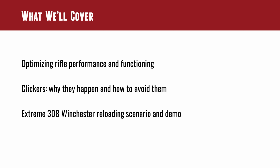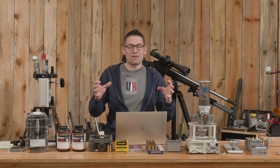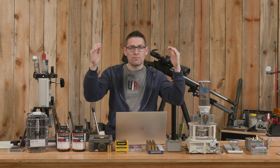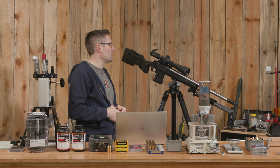In this video, I really want to get into what those phenomena are and talk about this correctness formula of the correct brass, the correct rifle chamber, and the correct sizer die dimensions that can bring all of this together and help to avoid any of those problems and elevate the performance threshold that you can push things to. We've got some pretty extreme examples to talk about. Let's start by talking about the clicker, right?